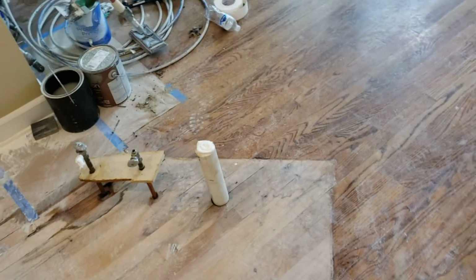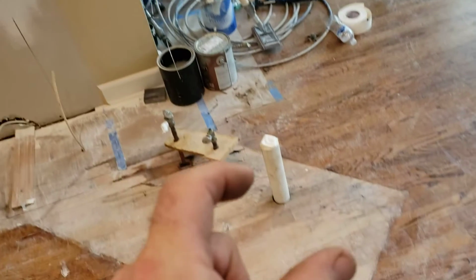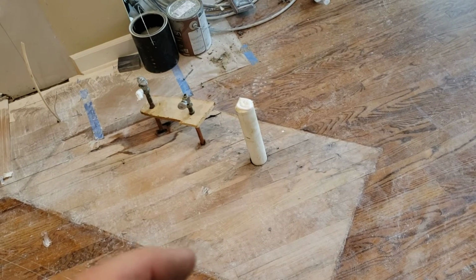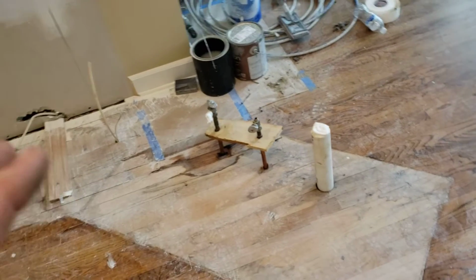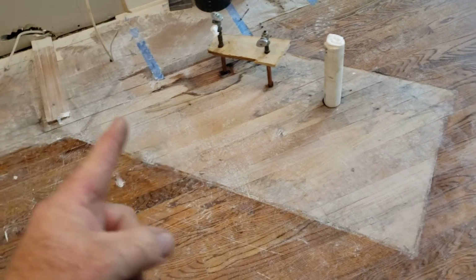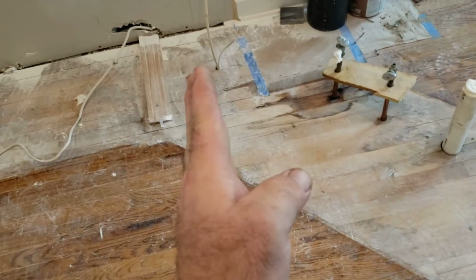And that's important because the apron mounted sink that's going to be in this one would only have a 3-inch wide return down the side of it. And I don't know if the granite company would actually build that because of how fragile that would be on that return for the sink. So one of the things we talked about was moving the sink to the left, justifying it like it was originally right to the corner, and then having about 6 inches or 9 inches of space here. Turn the corner with an end panel.